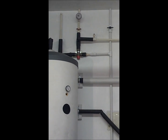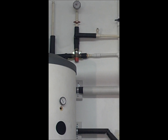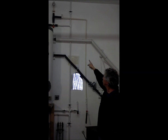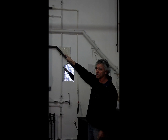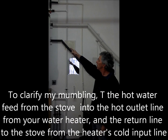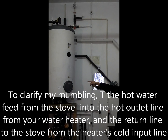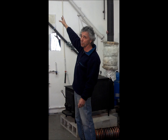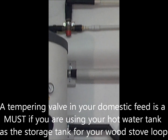I'm using the storage tank before the electric hot water heater. If you're just after domestic hot water, you could go directly into the hot water heater, feeding your hot line — your top line — teeing into the T out on the top, and feeding your return line into the cold water feed at the bottom. If you do that, you absolutely should put a tempering valve in.